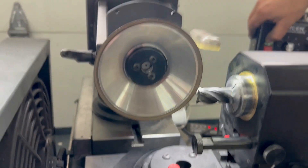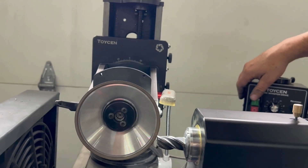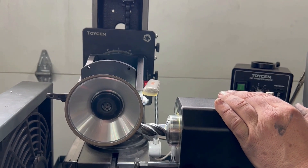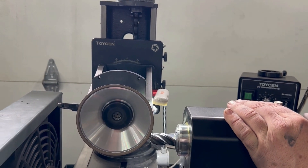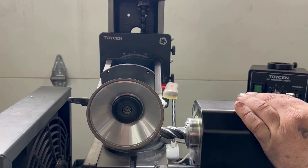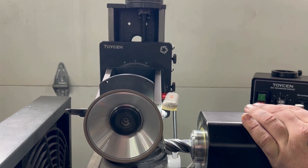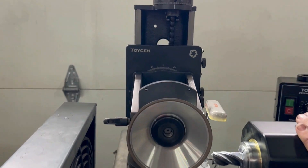Now we're just going to gash. We're not going to go as deep in this case — we're going to go in until we come in contact with the secondary and then take 15 to 20 thousand. Now you've got to pick up the other flute independently also.